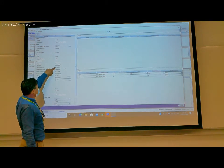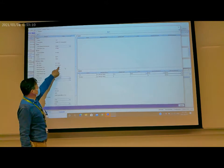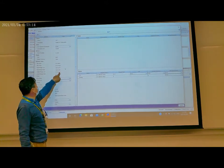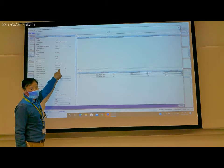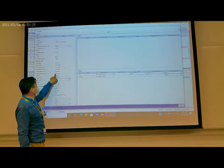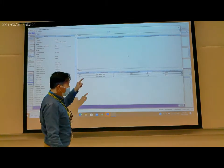If the resistance is 101.8 ohm, then the output temperature is 32 Fahrenheit degrees. And if the resistance is 138.8 ohms, then the output temperature is 212 Fahrenheit degrees. So this one is okay. Then close it.